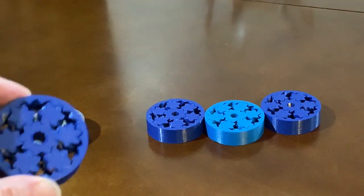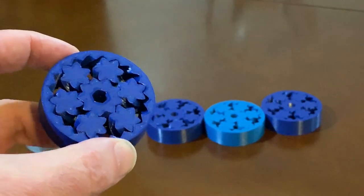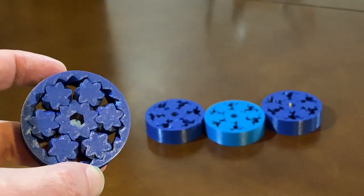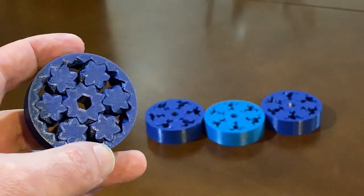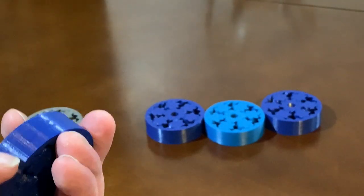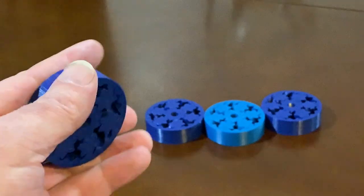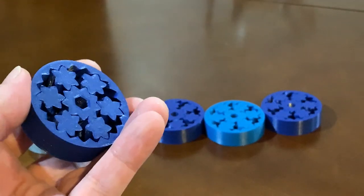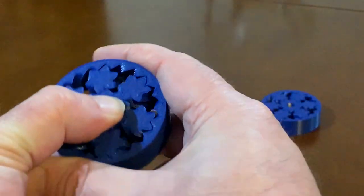At one point I tried to print this gear bearing in a different color. This was on the second or third day that I had the printer. I didn't have any other filament, so I had to print it in PETG to get a different color, and so I sliced it in Prusa Control. I noticed when I printed the silver one with the Prusa G-code that it had 0% infill, so I chose 0.15 millimeter layer height and 0% infill, trying to get as close to that as possible. It printed, it worked, and I eventually was able to make it move, but it's very difficult to move.